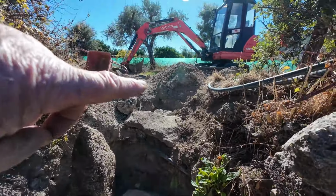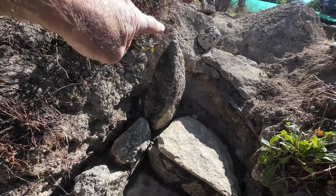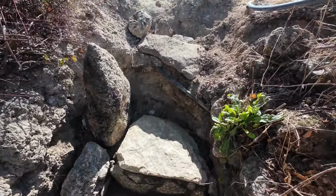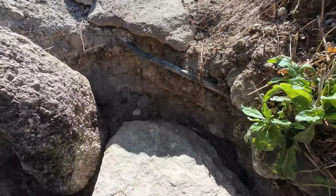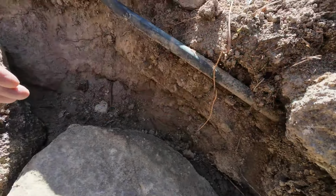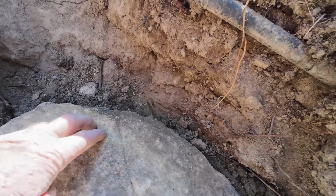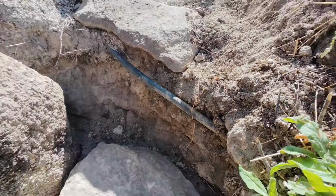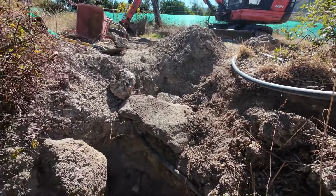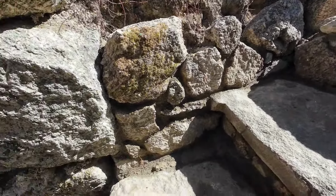Backfilling behind with soil. Plenty of soil here, and then put another layer on until we're built up to this sort of height here, to ground level, top of this one sort of level across here. And then I do have to dig this electric cable in a duct here. I'll dig it back that way, build up here, put our next build up on the riser off of this, build a riser up for another slab to go on top of that, and then that'll be maybe one more step after that, and we're done. Yeah, all fits in fairly well.